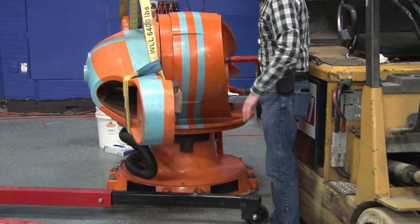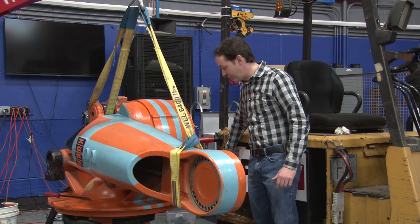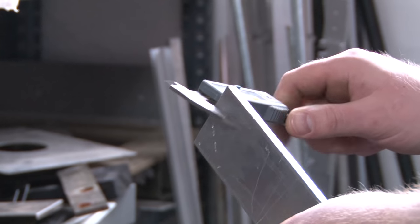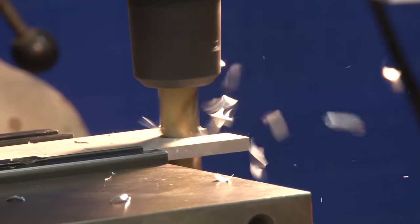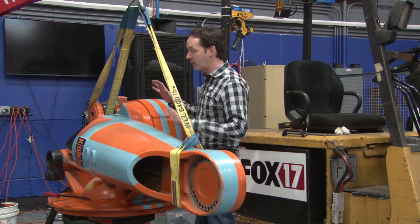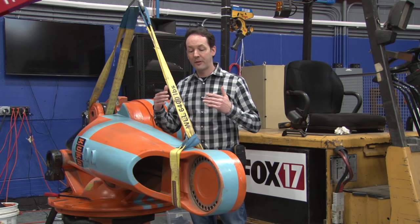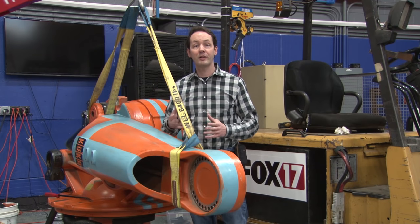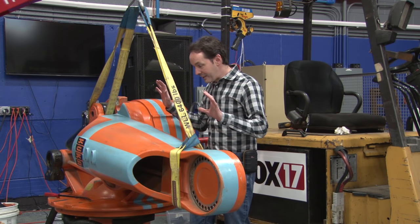What we've done is we've got this slung up, we've got a hydraulic ram out, and we're using the forklift as ballast — basically a big heavy mass. We've got the big steel counterweight on the back of the forklift and we're going to be pushing against that. The only real concern here is not breaking anything inside, so we've got Casey's custom wrench inside that's going to disperse the load across the gearbox so we can just push it right out.